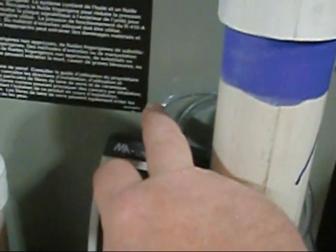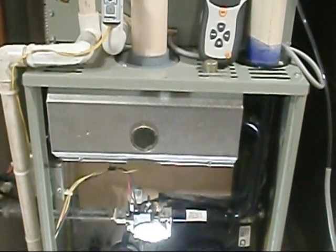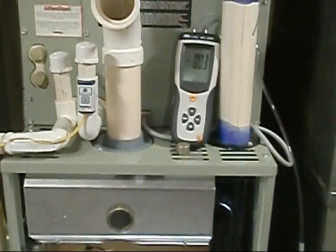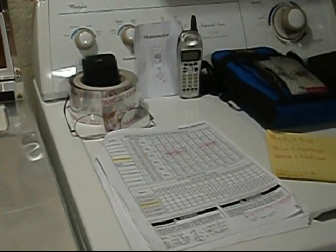I've taken my regular hoses and inserted them into the negative port — I determined that by sticking my finger over it and when it sucked down it pulled into a negative pressure. What we're here to do is determine what speed the fan motor should be set on. I have a two-and-a-half-ton American Standard 13 SEER heat pump outside. Each ton equals 400 CFM, so two and a half tons means we're targeting 1,000 CFM. We have the manufacturer's engineering specs to find our target speed.